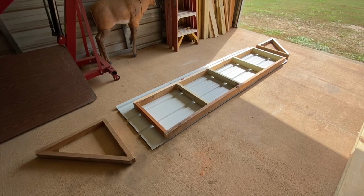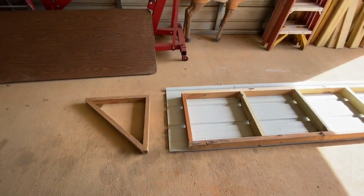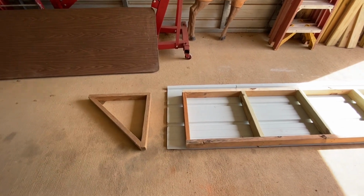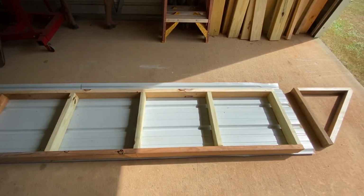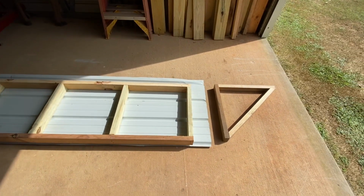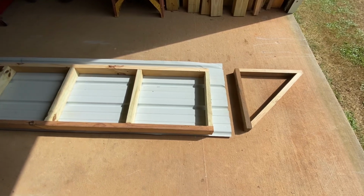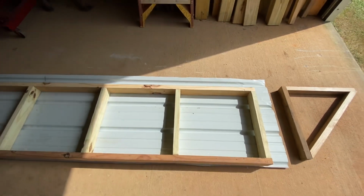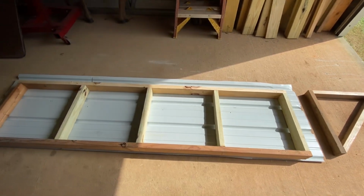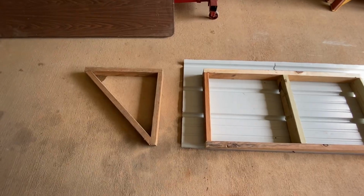This is the completed roof extension on our cook station. So you got the 90 degree elbow on the left side, and this is from the underside here. And then you have the 90 degree elbow on the right side. We got it overhung 6 inches on each side. In case you're wondering why it's overhung more there than on this side right here, it's because we got to overlap it with our pre-existing cook station. So as you can see, it's overhung there too, 6 inches.